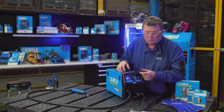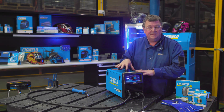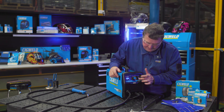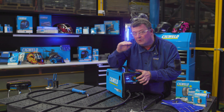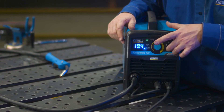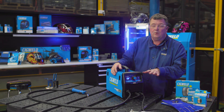If you've been playing with the settings and you're not sure where everything should be set, you can do a full factory reset on this machine. Hold the soft button and the control knob together for four seconds, and that will change the display to show three horizontal lines - that's when you know the machine has been reset to factory settings. It's that simple and that quick.